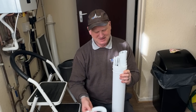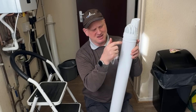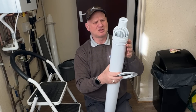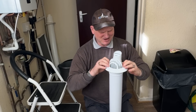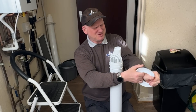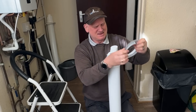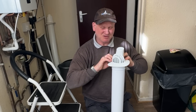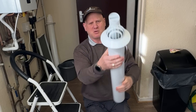Just to continue my gripe about the flue system — you've got your collar that needs to slide over the top, and it's as tight as tight can be. Some guys stretch it, pull it apart to get it on, and some guys soak it in water. But by the time you've got it on, which does look quite nice and neat, you've ruined all the sand and cement you just put in.